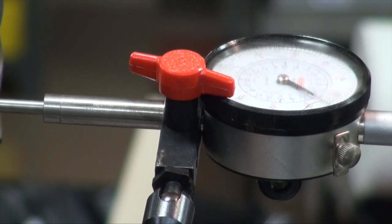It kind of moved just a little bit and I just barely snugged them down. So I'm going to tap it around — it looks like I almost broke the gauge. I'll go ahead and snug these down just a little more and check and see if it moved any. I still got less than a thousandth. So I'm going to go ahead and just put them down. I've got, let's call it an honest thou — one-thousandths run out right there. You've got to remember that you do have some bearing play in here; I can move it eight or nine just because of bearing clearance.